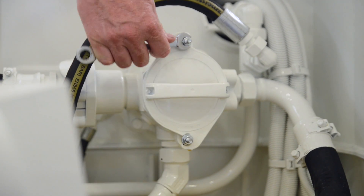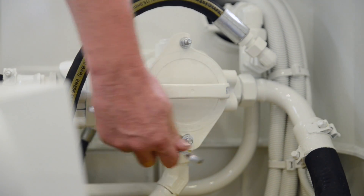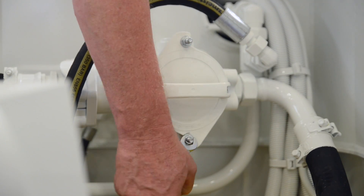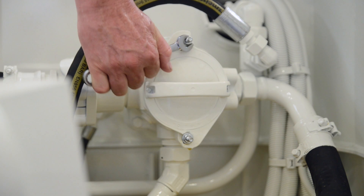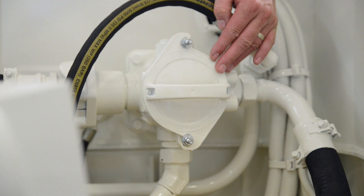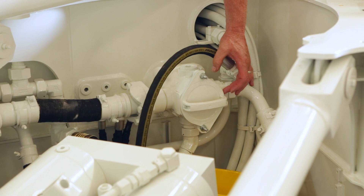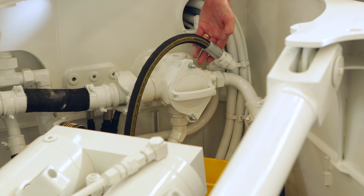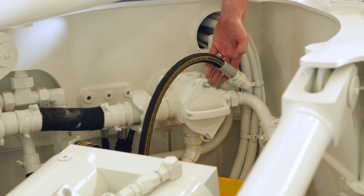The cover is sealed by the O-ring, not by the torque of these nuts — so snug them down good, but do not use a breaker bar to over-torque them. This filter is self-flooding, which means when we push the filter canister back in, the oil from the tank floods the chamber, thus pre-filling the filter. There is no need to prime this filter.